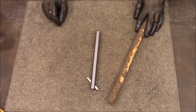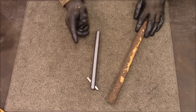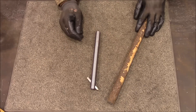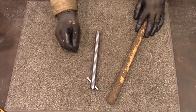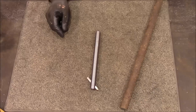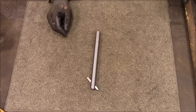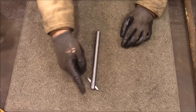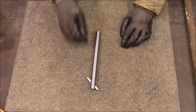I suddenly came in need of a boring bar. I broke a carbide one and needed to finish up a project, so I needed to make a boring bar that I could put either in my boring head or in my quick change tool post in my lathe. This is what I came up with. I've seen ones like this on the internet. I took a piece of steel — a whole rod off of a garage door opener that I got from my mother years ago — turned it down to three quarter, then put it in the mill and made these holes in it.